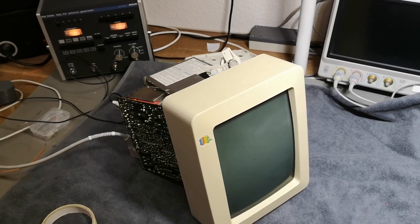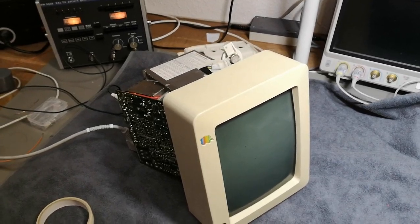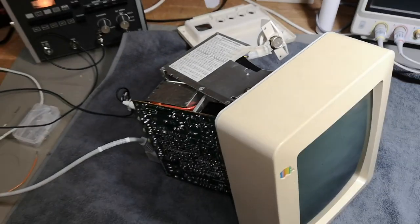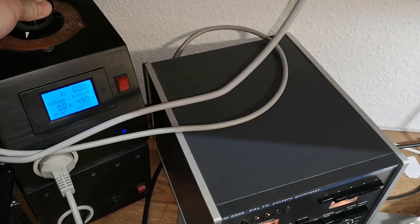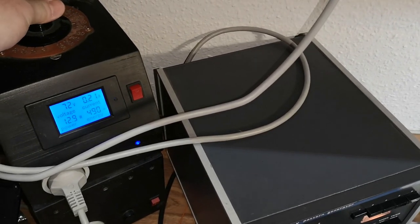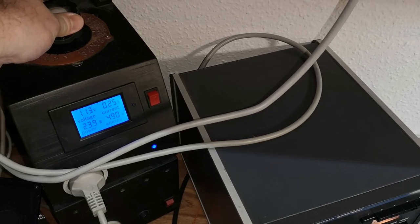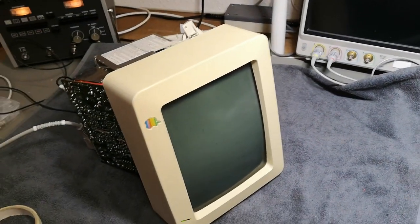So now I'm going to try my very first power up. I got video input from my video generator. And I think I turned this. Yes, I did. So the on-off switch is on. And actually I just crank up the voltage real slow, and then that looks perfectly normal, and then we stop at 115, so that's 24 watts. So far so good. Let's turn off.